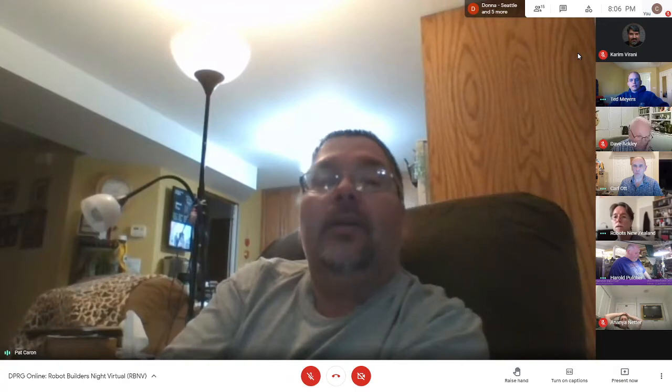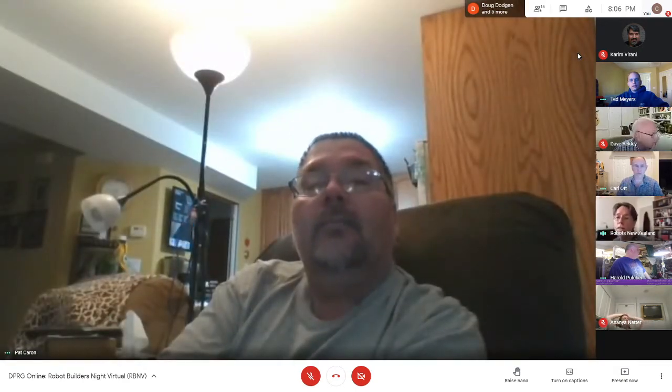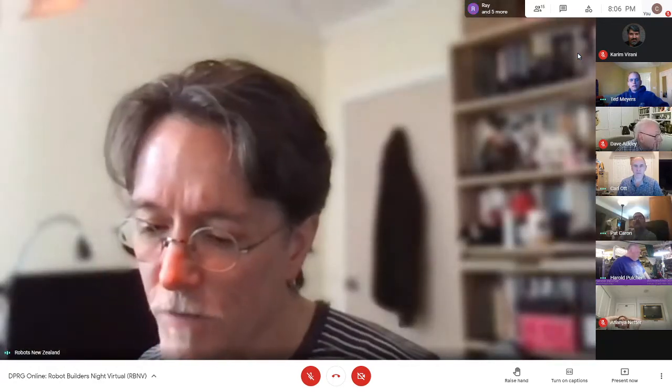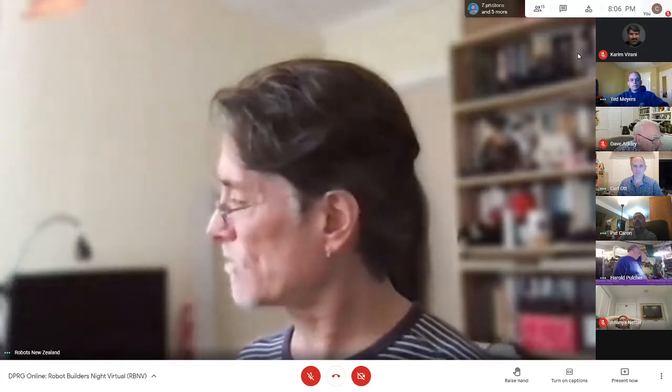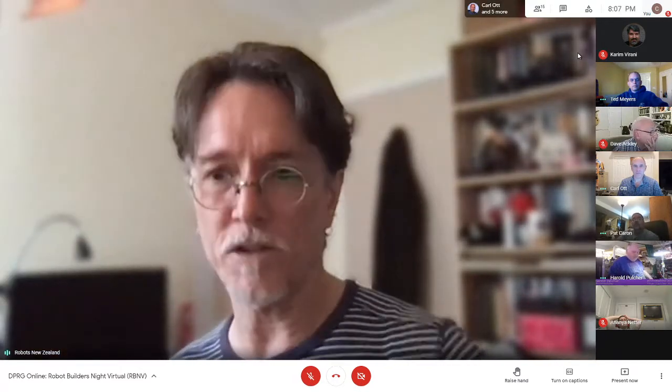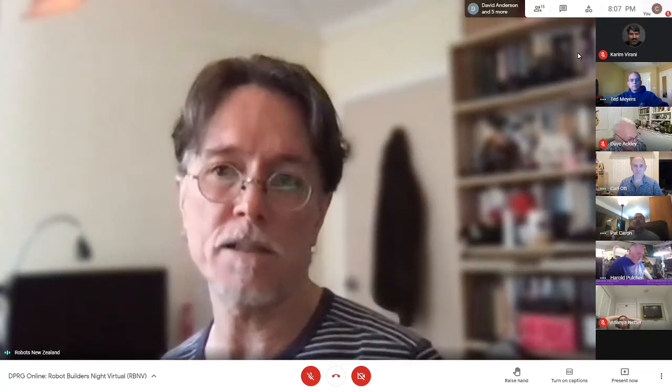So, Murray, are you using a mirror? Mounting that little sensor at a 90 degree angle and looking down through a mirror through a hole in the bottom? Oh, essentially, yeah. Moving your optical distance farther away. Yeah, the distance for that sensor is about, I think, 85 millimeters. I did a blog post about this, and I mounted it at 85, and that's roughly my 3 millimeter platform on my robot, about 90 mil. So it would function, and I tested it, and it does function.